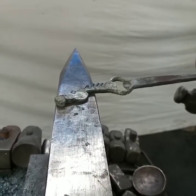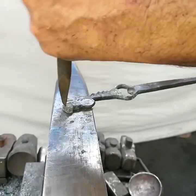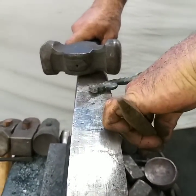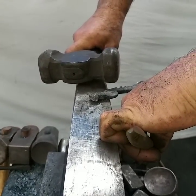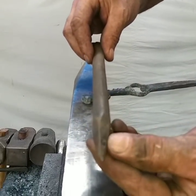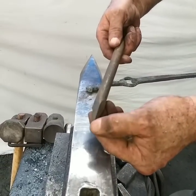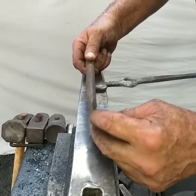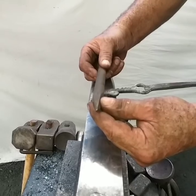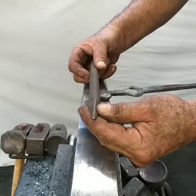I use black tool steel for my eye. It's a chisel, not a punch. And my nose is also a chisel, it's not a punch. It's also a square punch, a small square punch. And then I leave two corners, and then I grind one off, roundish. Then I do a little flat mark, and then I take a chainsaw file, and it's a little crescent moon. I use these for my 3D ones too. I just go further into the material when I use it. But they're chisels. They are not actual punches.